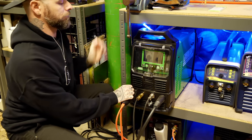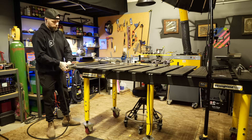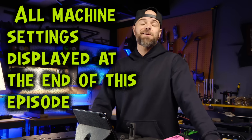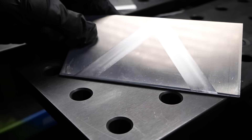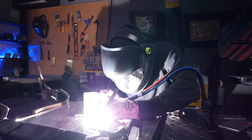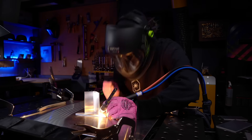Let's get everything set up with my welding machine. I'm going to be making some adjustments to my setup as I weld, so I'll show my final settings at the end of this episode. With my pieces, I'm going to wire brush all of my welding areas — I take a lot of time to do this with the same detail I'm going to weld with. I'll decontaminate properly, wipe everything down, tack carefully, and make sure I get good alignment with all of my joints.